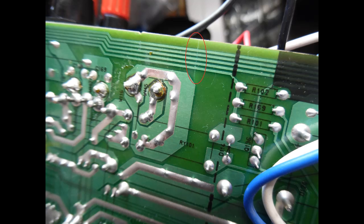The repair required scraping off the protective coating on those very closely spaced tracks to expose bare copper. Then link wire was used to bridge the gap across each cracked track. As I've mentioned in other tutorials: don't simply flow solder across a cracked track — it won't provide the correct mechanical strength or longevity. Link wire is the correct approach.